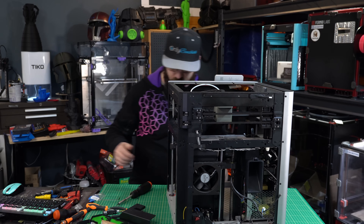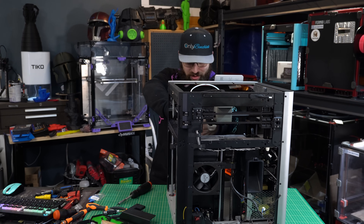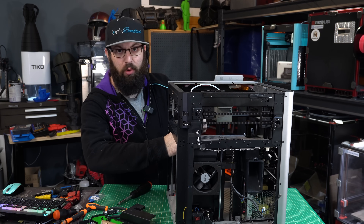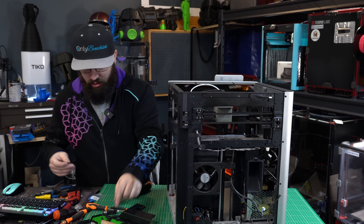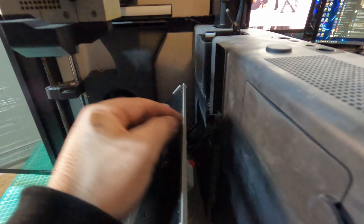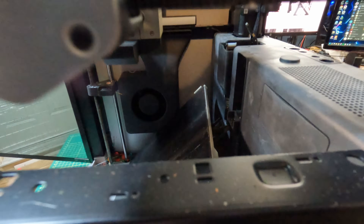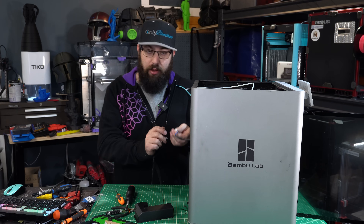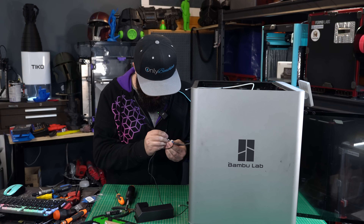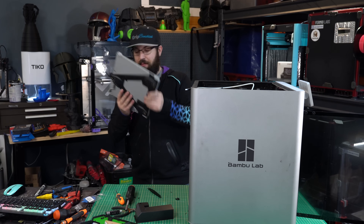Remove the screws holding the heat bed in. Nothing's easy to get at in here — it's all tight corners and not a lot of access. If you drop a screw, it tends to disappear into who knows where. You'll want some ball-head Allen keys with long shafts to work on this machine. Now we've got to get the bed cables out — they go through a really tight bend in there and you've got to push and pull to get the bed cables through. That's the power and sensor cables going through that pretty tight hole. I was wondering why the manual called for depin-ing the bed wires — that's so the actual wires will fit through this hole, since you can't do it with the connector on.